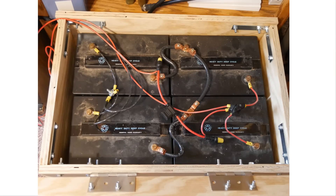This is my main battery bank. Those are huge deep cycle batteries designed specifically for solar service. They're in series-parallel — they're six volt batteries. The two across the top are in series, and the two on the bottom are in series, with cross connections at the midpoint. None of the wiring going in or out of the box is greater than 12 gauge, and it's fused for about 30 amps. Make sure everything is fused.